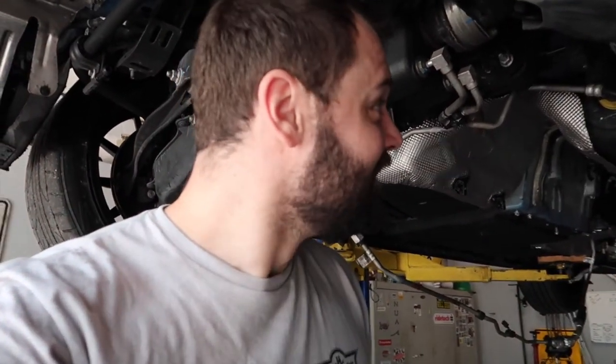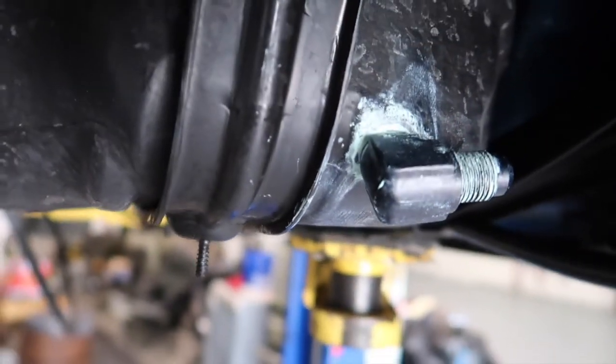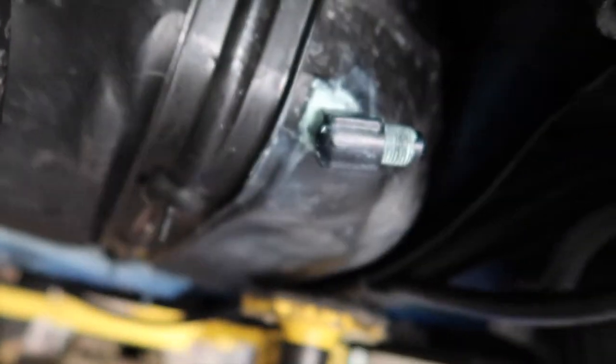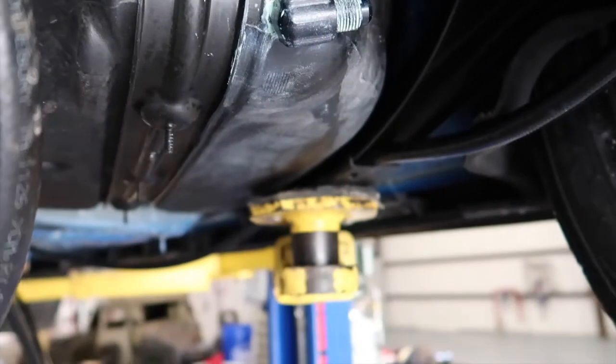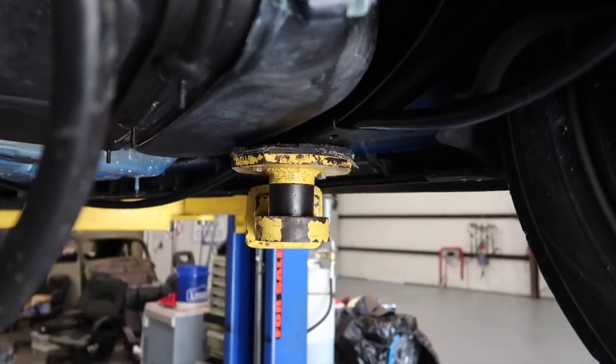I just got it drilled — my brother drilled it out for me just so I wouldn't screw it up. Here it is, simple but scary. It comes with this green stuff — it's almost like liquid plumber's tape — and you just goop it all up, then thread it in and it's supposed to keep a dry seal. You don't want to over-tighten it because if you do, you'll strip it out since it's obviously just plastic — just snug — and what's actually making the seal is this stuff.